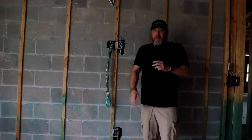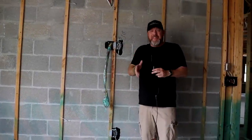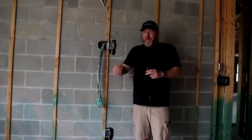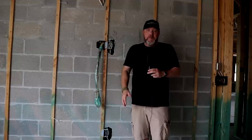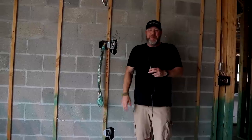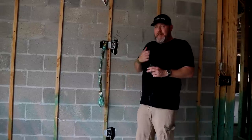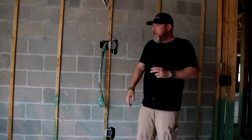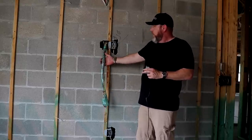Gene, I want to talk to you a little bit about how we wire our distributed video — some little things that we do as integrators that differentiate us from 'hey, I know a guy who can run wires' or 'my electrician can just do it.' Electricians do great at electrical, but most hate doing low voltage. Something that all top-shelf integrators do is run our trunk line — our distributed video outlet — through a P-ring.